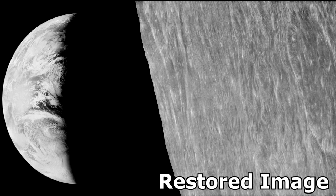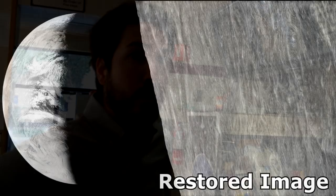The demodulator — we've just got to explain — that's taking the signal and converting the raw radio signal on these tapes as it was transmitted back to Earth. It's not image data. You have to apply a process to that data to turn it into essentially TV data, and then you take strips of that TV data and assemble them into a final image.